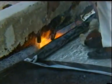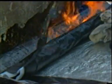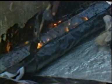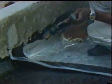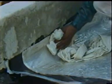Special care should be taken to lay Multiplus sheets along the rounded edges or gola for full bonding by fusion. Polymeric bitumen primer coat is applied on the rounded edges and the Multiplus sheet is pressed after heating with blowguns for fusion.